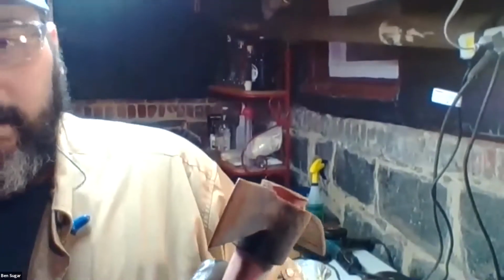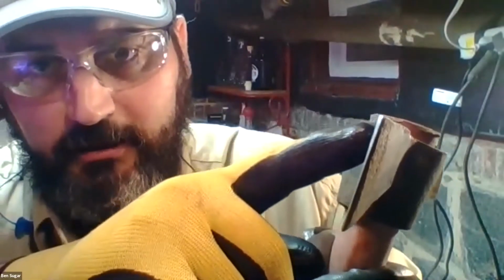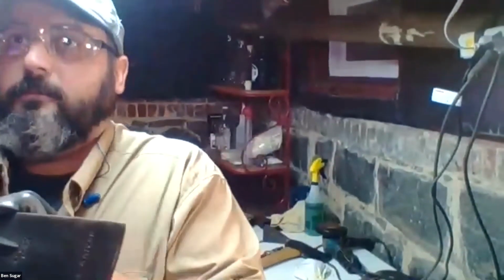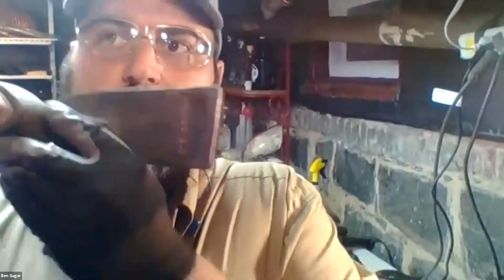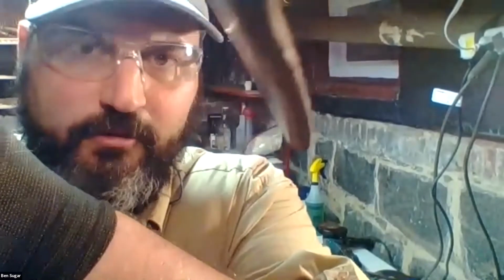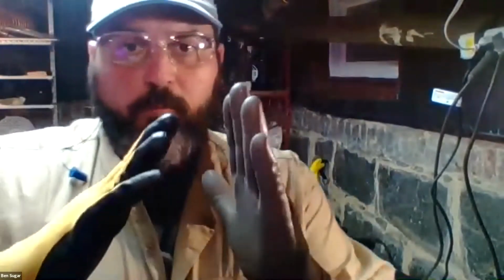First and foremost, look at what's called the bevel of the tool. So hopefully you can see that there's a double bevel on this, the axe head of this Pulaski. Both sides. It's meant for chopping wood. And then back here, there is technically two bevels on this mattock end, but really we focus mostly on one. You can treat it as a single bevel. And that means there's only one versus two tapers on the blade edge.